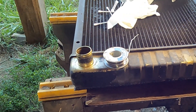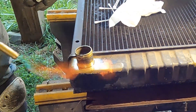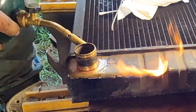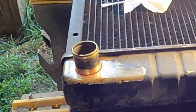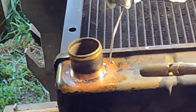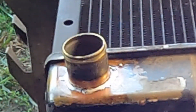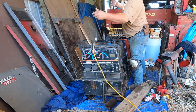After I took it out of the welding machine I laid it flat — of course there's no water in it — and I cleaned it with a wire brush, stainless steel hand brush, and a wire wheel stainless steel brush that I used on a battery-operated drill. Then I used some resin, got it real nice and hot so that it cleans that whole fillet area. I used 60% tin and 40% lead and put a bead on it until it was three-sixteenths of an inch all the way around onto that water neck. All fluids have been put in — there's no leak in the radiator anymore.